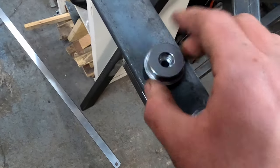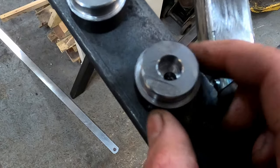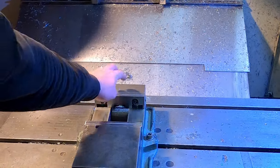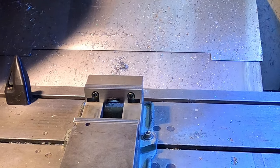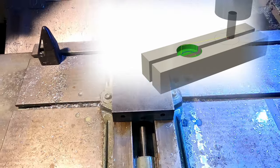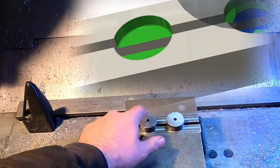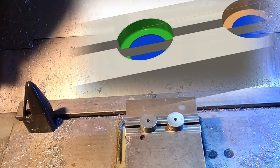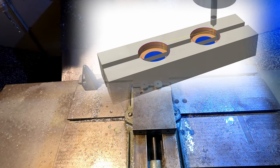There's two rejects so far — the one that came loose in the vice and then this one where the stock wasn't on there. So I've flipped those soft jaws over, now to zero in so we can make the soft jaws to hold these for OP2. The operation ones of the link bosses are loaded in the vice, ready for operation two. Just crossed everything goes to plan.